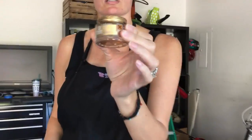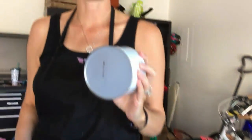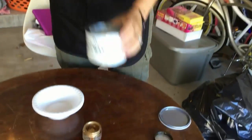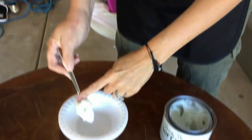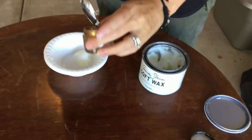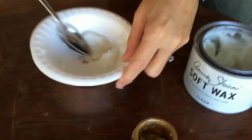Now we're gonna mix the gilding wax glaze. We're going to start with the gold gilding wax in Kings Gold — there's a link on where to get that in the products down below. Then we're gonna mix just a little bit of that with Annie Sloan clear wax. We'll take a spoonful of clear wax, put that in our bowl, and then take just a little bit of gold wax — it doesn't take much.